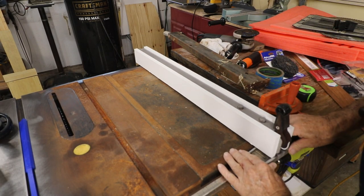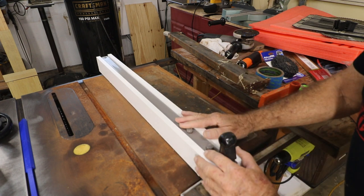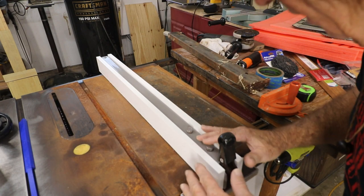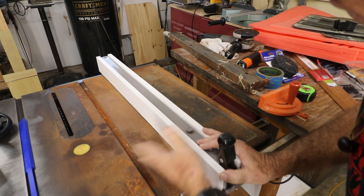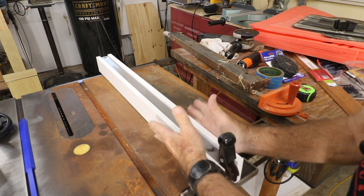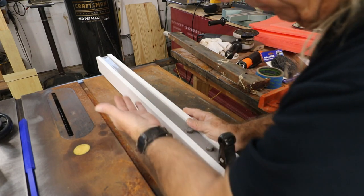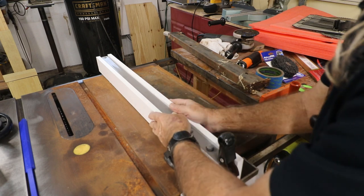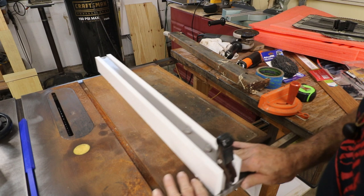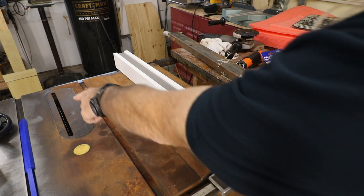This was a bit of an overhaul job, so I want to show you what was involved. Obviously I had to brush it down and clean it up. I've added these side boards here to make the fence a little bit fatter — this is also sacrificial wood which we can run up against the blade when doing something really tight. It gives the fence more weight and more features, and the fence now slides back and forth nicely and keeps the 90-degree angle to the blade.